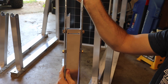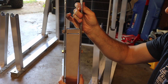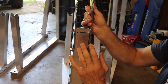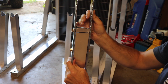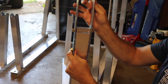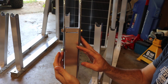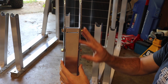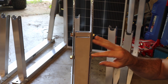At 25 and then 30 degrees you'll have to take out the bottom bolts to adjust higher. Set it to your latitude — we're about 32 degrees latitude in this area, so that would be perfect for our sun angle. The nice thing about this is you can refer to your sun charts and readjust in the summer or winter to get the most efficient angle to the sun.